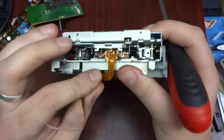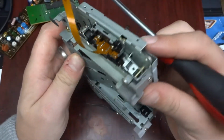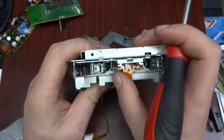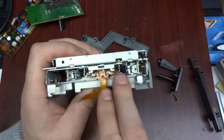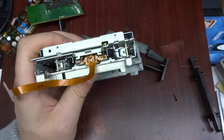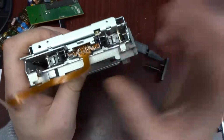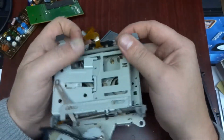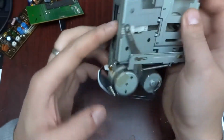And yeah, that's why you've got quite a few more cables coming to it. And there are, I think, two erasing heads, depending on which direction you'd be going. Instead of using a permanent magnet, I think they're using an electromagnet here. They press continuously against the tape in the cassette, but they would only switch on one of the electromagnets depending which direction the tape is going. So that's what would erase the tape before actually recording something on it. And also the rollers, those would switch depending on which side of the tape you're listening to.